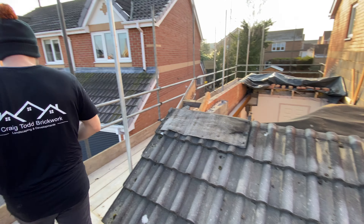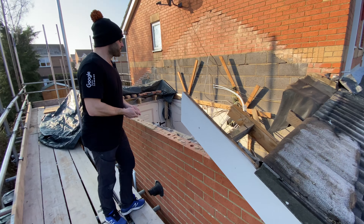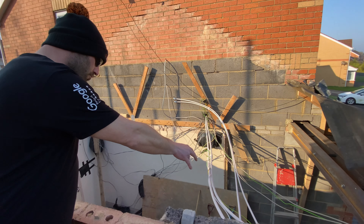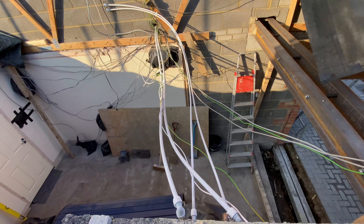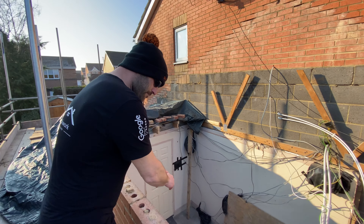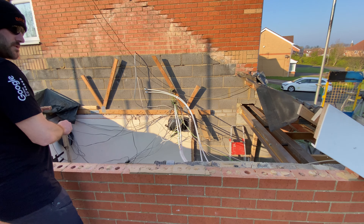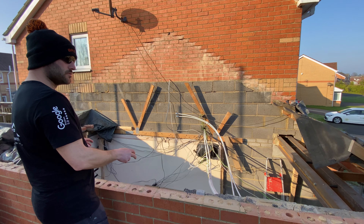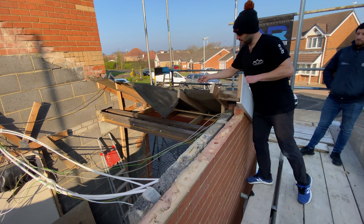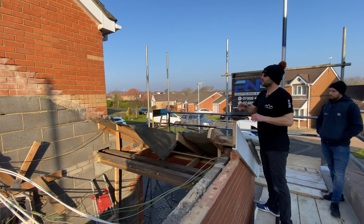So this is phase two. We're going to be starting straight after this garage door opening. Nick and the team are going to come here and what they need to do is put the new floor joists on, which are going to sit on top of this steelwork here, which they have already put in. We'll then beam fill in between this, sort out this brickwork there. We're going to put one course of bricks over here, one course of blocks over there to start our ties, then come over on top of the steel and build this up in blockwork. And the same as downstairs, we're going to take out the halves on the house so we can build into there.